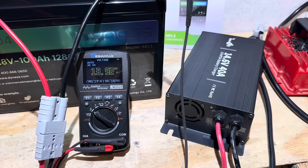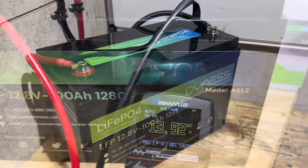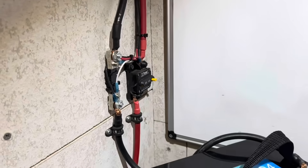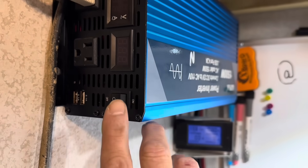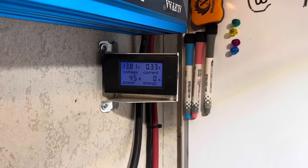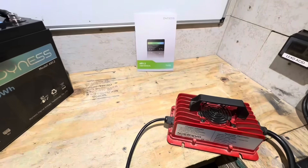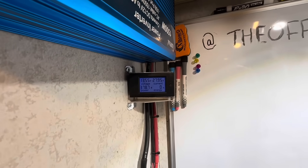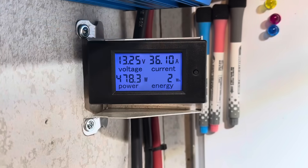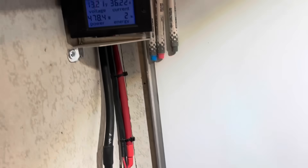The Dyness battery has completed charging, so now we'll remove it from the charger and hook it to the capacity rig to see what this thing's made of. Got the Dyness connected to the capacity rig — same one I always use. Got the energy meter zeroed out, nothing's been turned on yet. Now I'll turn on the inverter and here goes the load — same load I always use, that little charger charging back to the 12 volt rig. We're at 36 amps, 478 watts load on the Dyness battery. I'll let it run and see how much capacity this thing has.